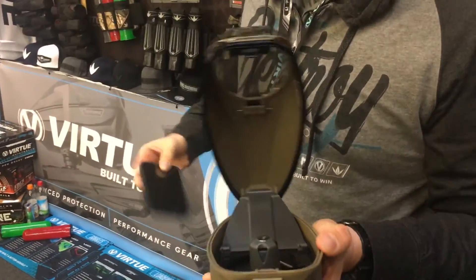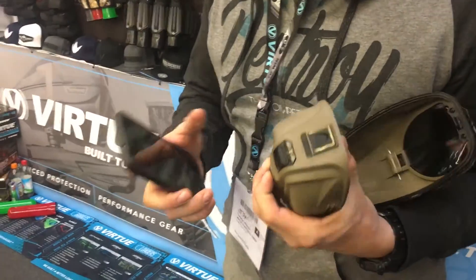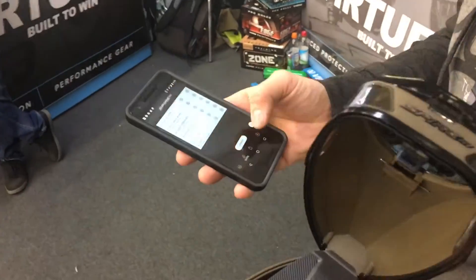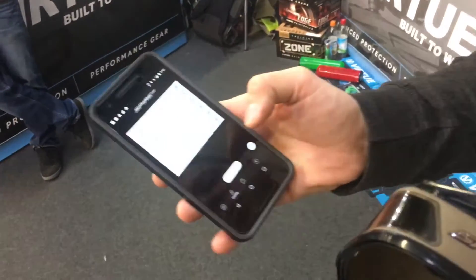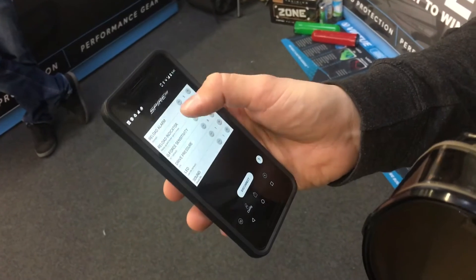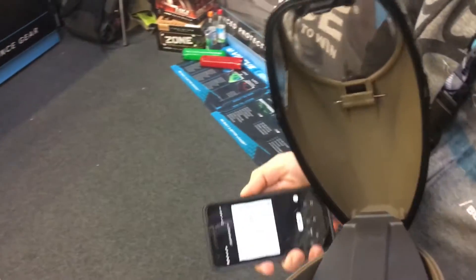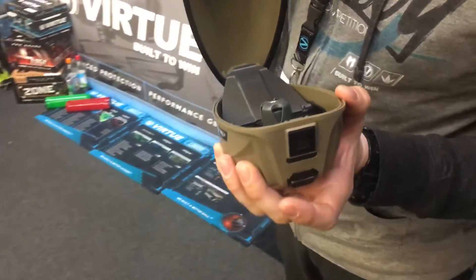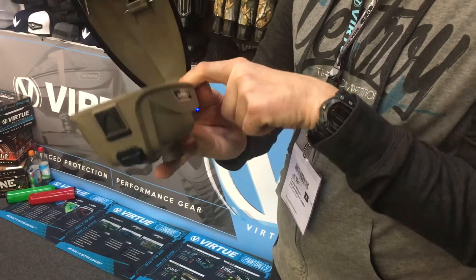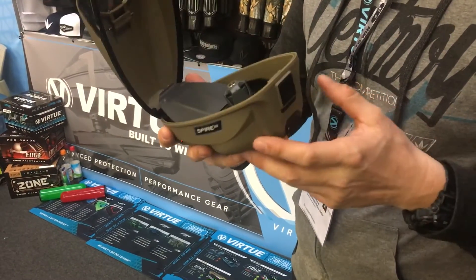You can fine-tune that. Let's go back in through the app. I want that alarm to go off right away. Pull the button in, turn the loader on, connect, grab the Spire. I want five beeps right away when the ramp goes up. Disconnect and shut the loader off. Turn it back on — the loader's spinning. Hold the ramp down, you got your LED activation there. Ramp goes up and you get the five beeps.